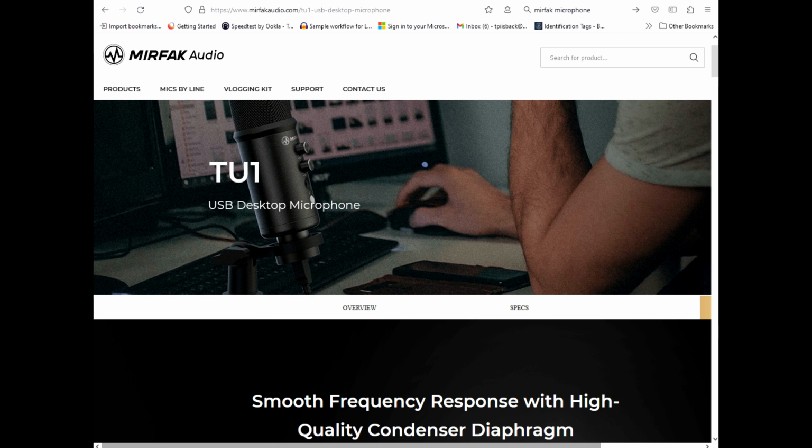There is another feature, which is noise reduction. And for that you hold down the button for 3 seconds, and it will either deactivate it or activate it. Right out of the box, it is activated. And what it really is, as far as I can tell, is a noise gate. So if the input volume that it detects starts getting quieter, it will turn itself down or off, blocking any background noise until it gets a signal, a sound that's enough to trigger it to turn all the way back up again. So let me turn that on.